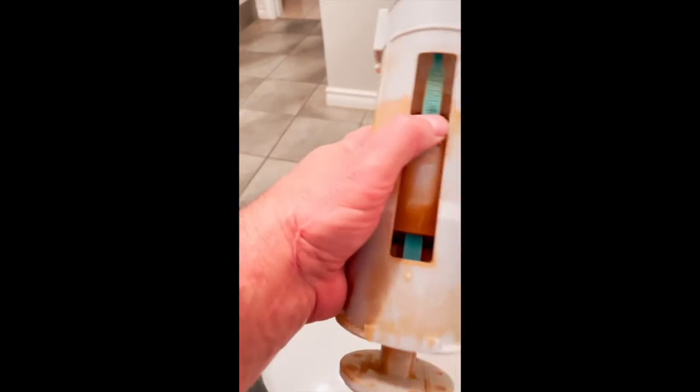This side is the low flush side and this is the high flush side. You can pull this side all the way down if you want a better low flush, but the high flush is the important one - when you push down it pulls the plunger out, simulating the old style toilets where you would pull up and the little flipper would come up.